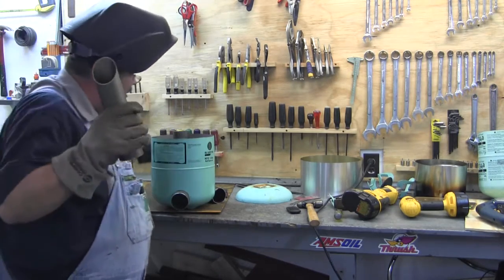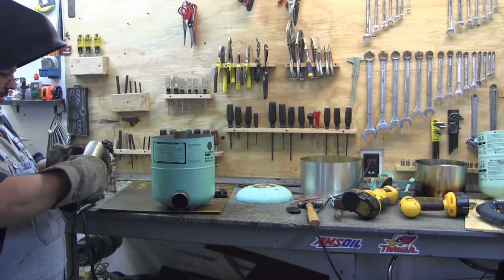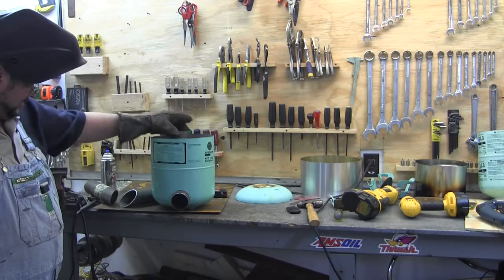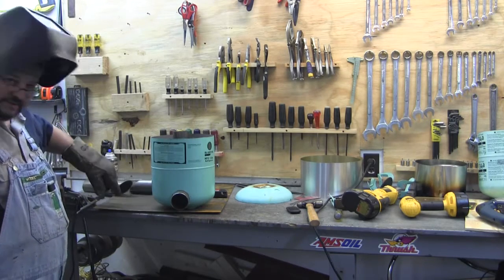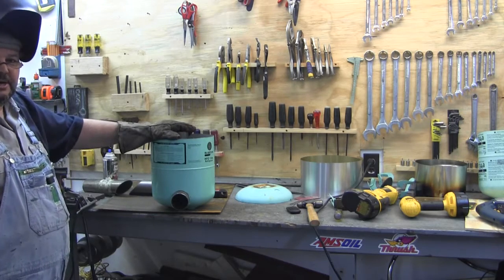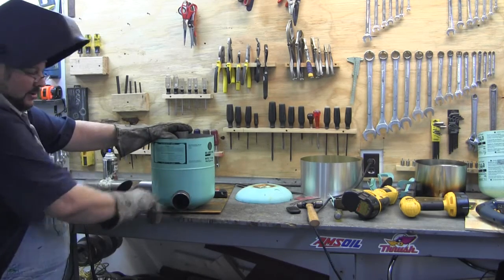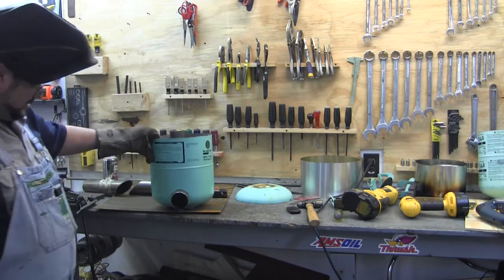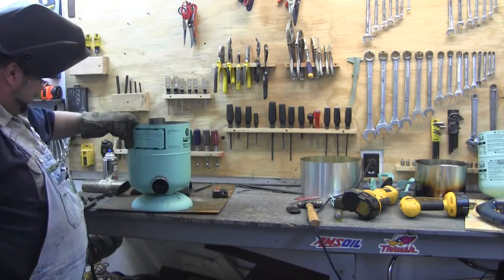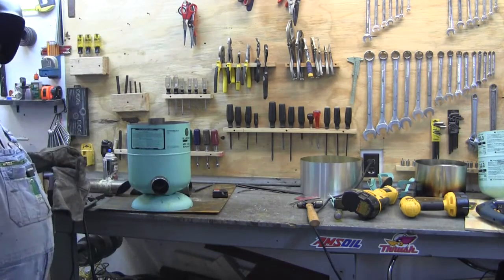There's one done. I've got to weld my other one together — I am making two of these. Then I'm going to take this back out, turn it over on this flat steel, trace out my circle, cut it out with my jigsaw with a metal cutting blade, fill this up with vermiculite, weld it back, weld the top on, weld the base on, and weld my handles on.